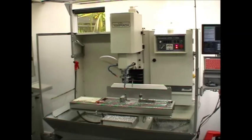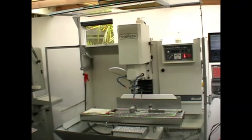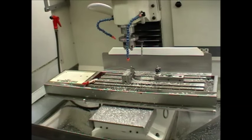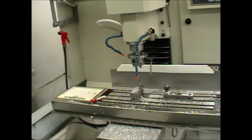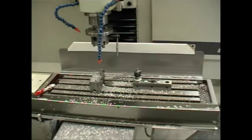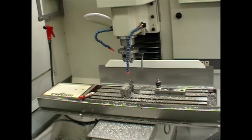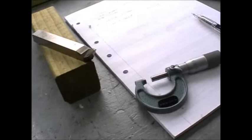This is the 1100 with the access enclosure front tilting door lifted right up — I only do that occasionally now for setup or maintenance. The whole point of earning money on a CNC machine, machining multiple parts, is to have it running automatically. If it's running automatically and you can leave the machine, it doesn't matter how efficiently it runs as long as it runs. It's a low cost machine, and whether it takes two minutes or four minutes to make a part, it's earning you money. So let's go over how you can control the swarf — you don't want a ribbon of swarf, it'll tangle up.